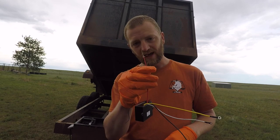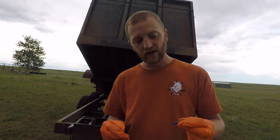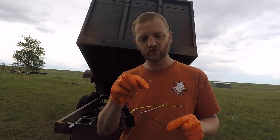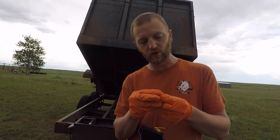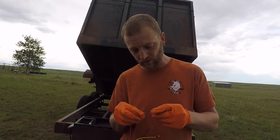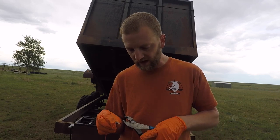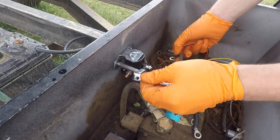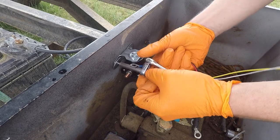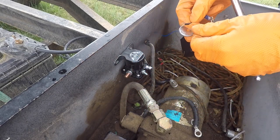If you have a fairly small diameter wire but need a large-sized ring to go over what you're connecting to, your crimp connector might be for the wrong wire size. What I normally do is strip back about double the length you actually need, twist the wire together, then fold it over on itself so it's a little bit thicker — that'll make it fit in the connector and you'll get a much better connection. Just be careful not to get any insulation or little fibers in there. Also note: I do have the battery disconnected, not only right here but also on the terminal itself. You could do it with the battery connected if you're super careful, but there's just no reason to take that risk. Just disconnect it — it only takes a minute.